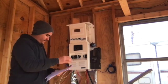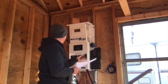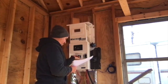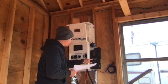All right. My next step is to turn on the inverter. Okay. That powers up the Magnum, and I'm going to turn on the inverter DC disconnect, turn on the PV array, CC number 1 PV array input. Here we go, there we go.